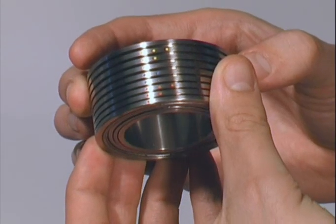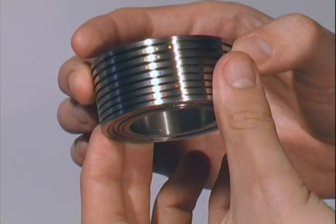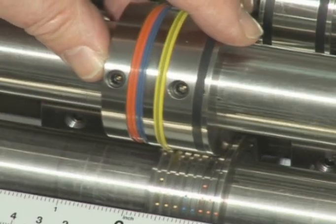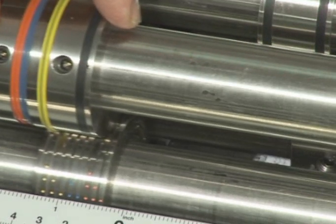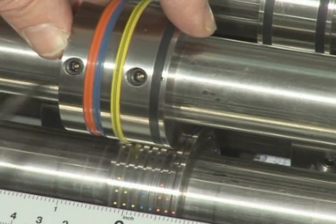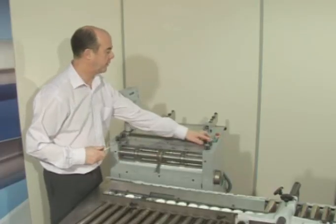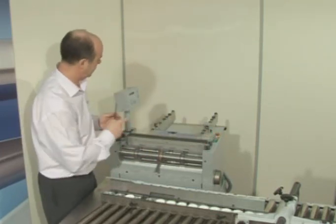Adjusting crease position can become 50% faster by choosing the specially designed bearing-loaded female option called the Counter Rotator. This clever adaptation has no fixing screw and can be dragged over by the male part during setup. Only the male component has to be fixed into place; the Counter Rotator simply self-adjusts and naturally centralizes itself during production of the very first sheet.